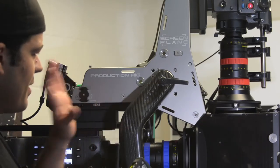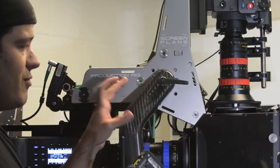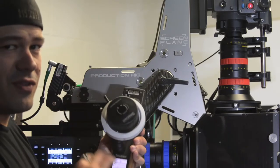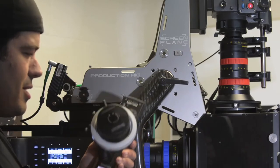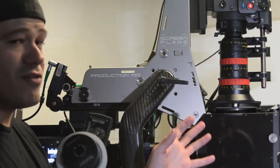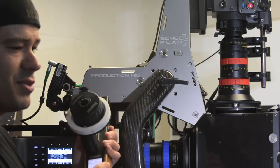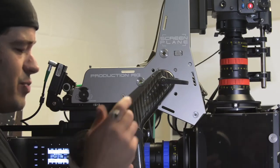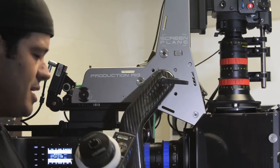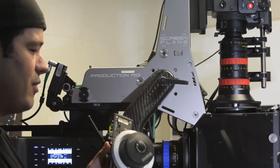The more advanced functions that come with the C display and the use of the screen plane rig inside of the 3D menu is something we'll get into in the next video. But pretty much, if you're just using an 8-motor Cmotion system on any number of rigs out there, mostly the only thing you need to know how to do is sync up the lenses and using the USB stick to load values and that sort of thing, and knowing how to use the quick sync function, which hopefully you've all learned how to do today.